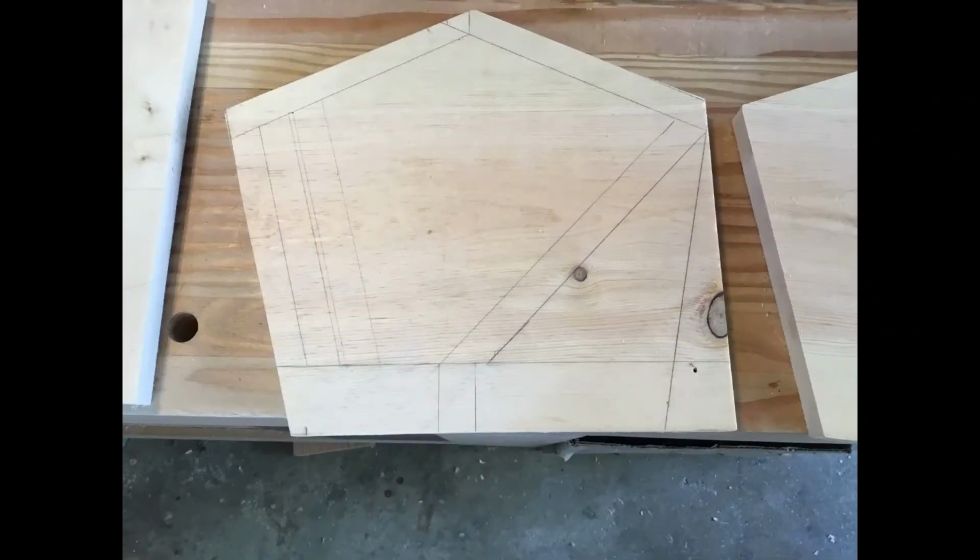Okay, here we go. And here we have the first of 3 photos. Didn't take a lot of them, but pay attention to that angle on this panel. Now, these are 2 end panels, and this angled 3/4 member actually goes to the bottom of that panel. It's just a little change I made. This angle is going to cause the bird feeder to feed to the front of the trough, which is at the left of this panel, by gravity.